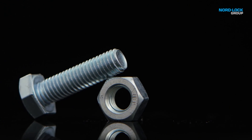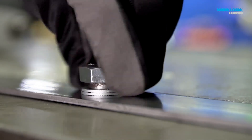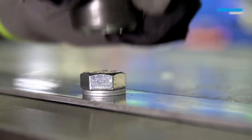But this does not apply to the design principle of the bolt itself. So a bolt is more or less the next generation of a rivet — it has a thread and a pitch, and the design principle of a bolt is to be pre-stressed, to gain a preload. We have to take care of the preload in the bolted joints from the design to the execution to the maintenance, because otherwise the bolted joint would lose its intention.